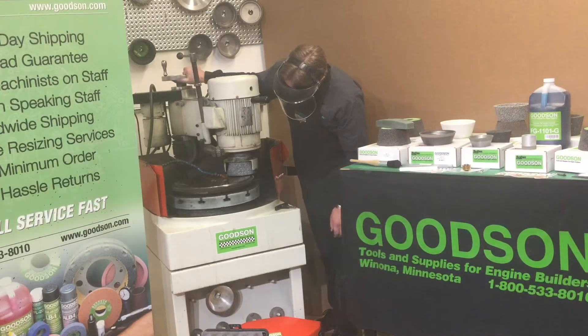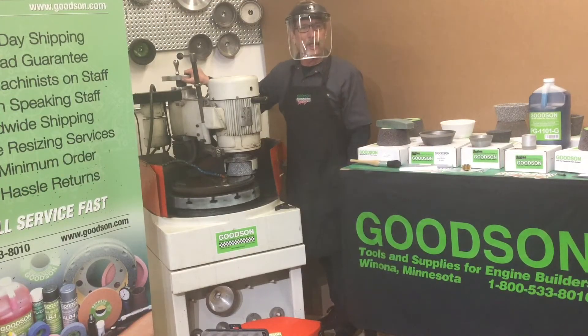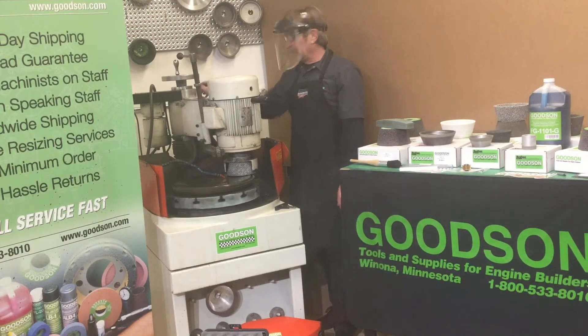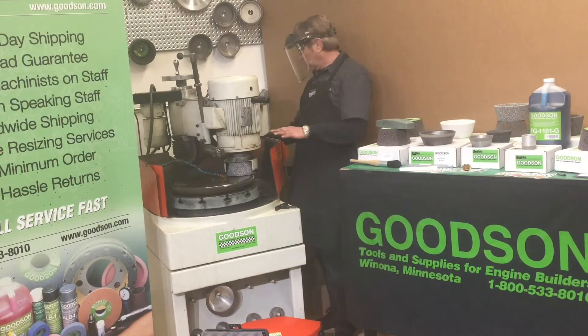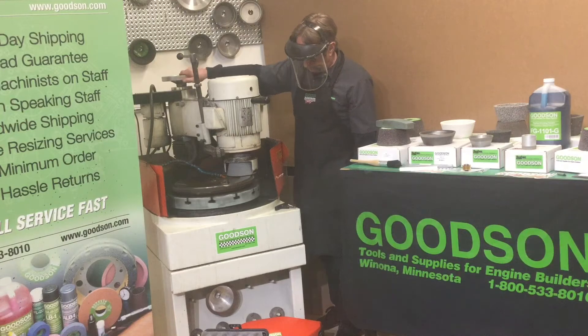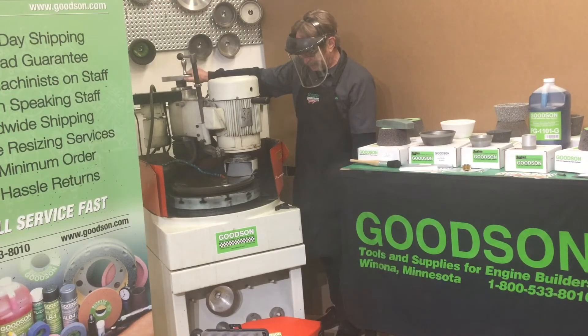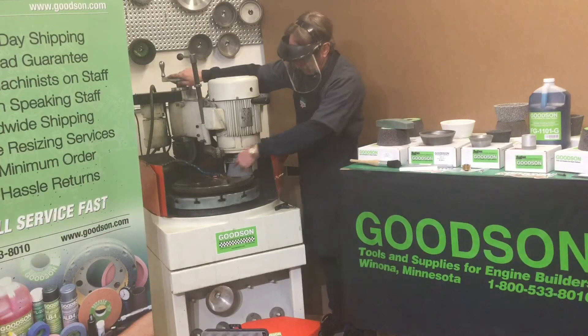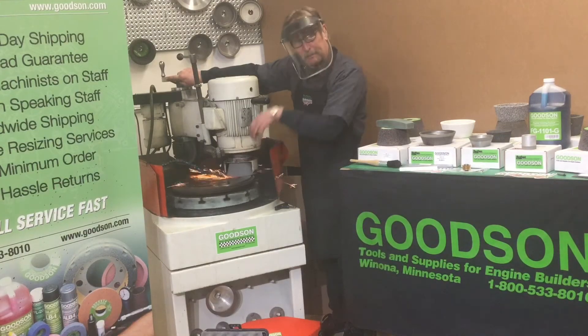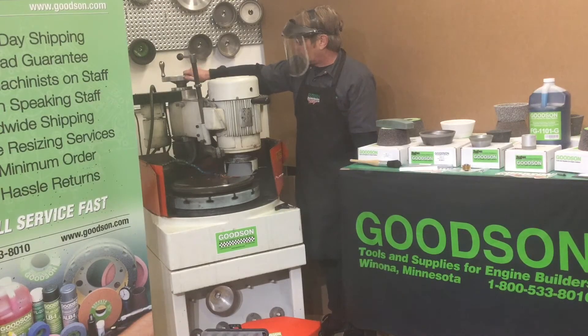We'll go ahead and feed that down. When I get close, I'm going to go ahead and fire up the machine. All you people watching this video, be sure you've got your face shields on because I'm not going to put that front guard back in place. My head's locked in position, my table's going, my coolant's going. I've got a quick shower spark coming out of here — that means I'm being aggressive with the grinding wheel against the workpiece. I take that in until it's all cleaned up all the way around.